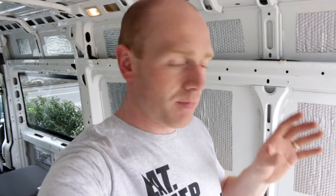Right, so we've learned that if we want to take down timber from 44mm down to 30mm, we should use the table saw, not the planer. That took far too long. It needed about 7 or 8 passes per piece of timber, gradually taking it down. But now they are absolutely bang on 30mm. I even checked with calipers, so they should be spot on with the insulation.